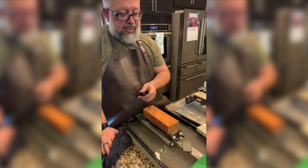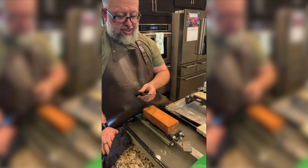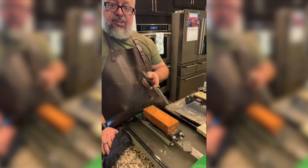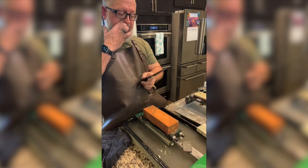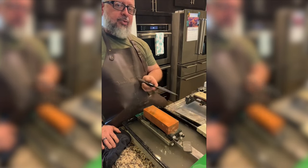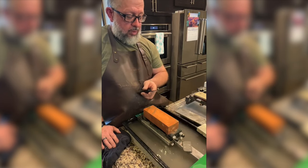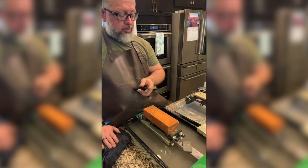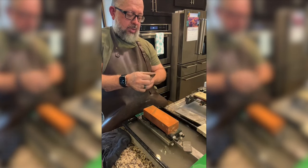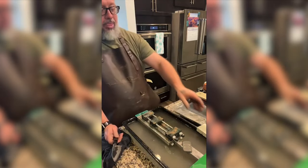Typically, doing a crisscross pattern is an advantage. The metal is changing its temperature right now from the water. So I see scratches from here, and I don't know if these are the scratches made by this stone or the scratches that are not being removed by this stone. Does that make sense? They do seem finer. So I'm going to go to the next stone and see if that does something. Can always go backwards.